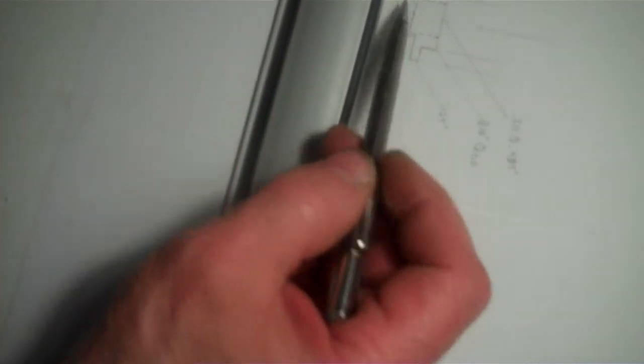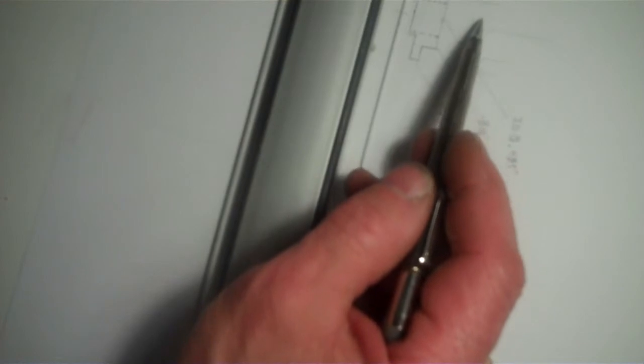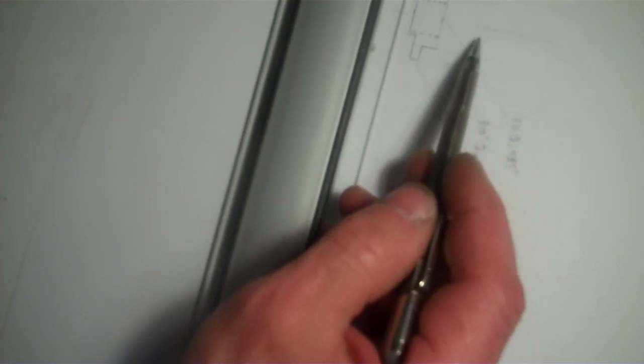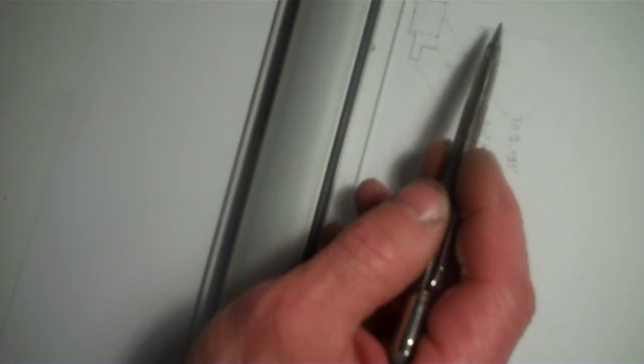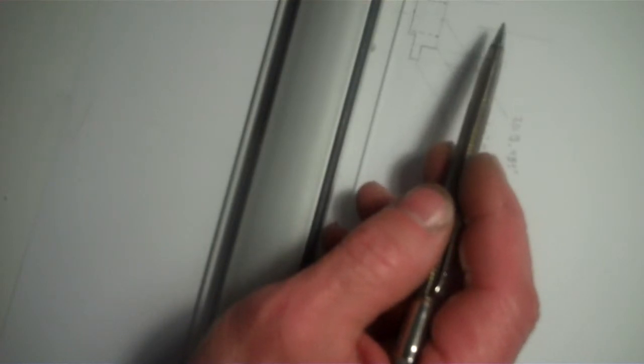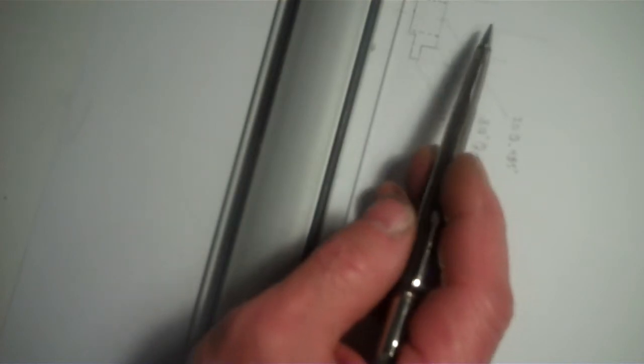Okay, I need the shaft fixture to go below here, to come up through here, to have a flange on it so they can push this in, and then to be turned down to about 3/8 of an inch in diameter to be able to fit into my tailstock chuck. Because I have a 1/2 inch chuck, and this is 800 thousandths of an inch wide here, so the diameter has to be cut down even less than a 1/2 inch, just to be able to comfortably put that in my chuck. So that's what I'm going to draw over here now. I'm going to draw the shaft fixture.